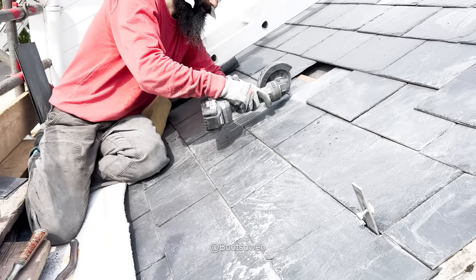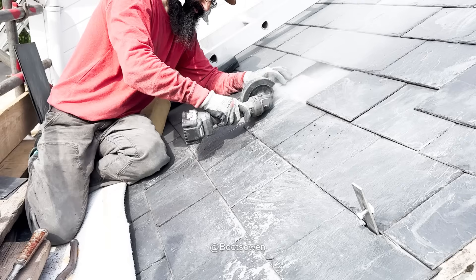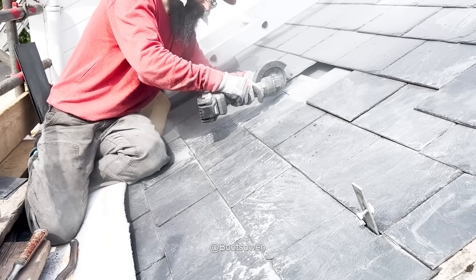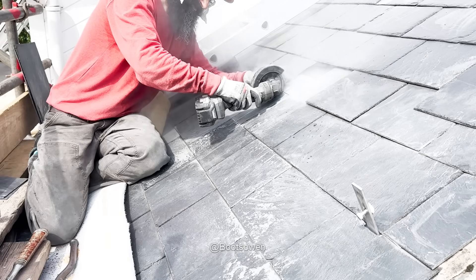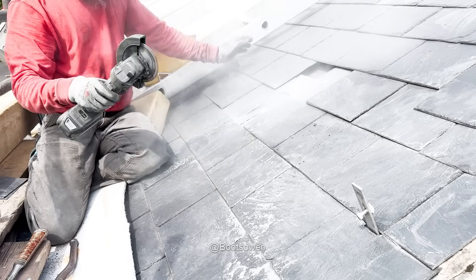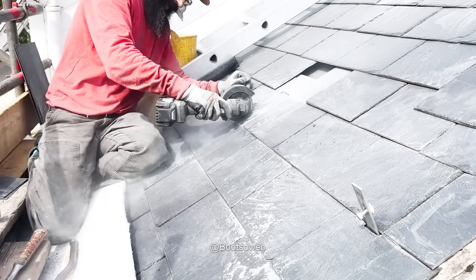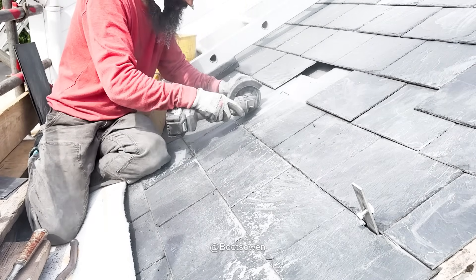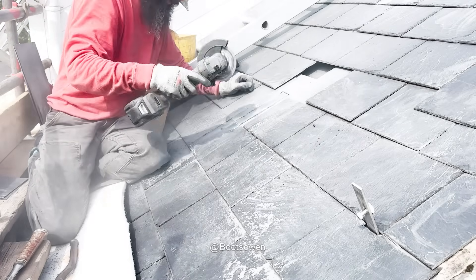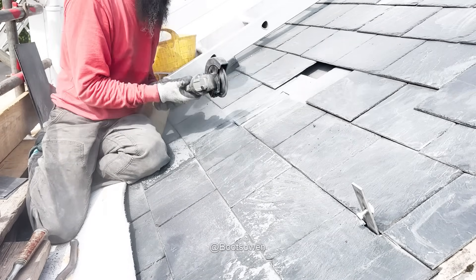Battery grinders are the business. In the past I would have been doing this with a cable and all that bother, or trying to nibble it out or remove the slate and cut it elsewhere. Now with this battery grinder — and this is only a little one, an Aldi one, great little thing — it flashes through and makes a good bit of dust. I've got earmuffs on but not dust protection because there was a breeze blowing. You cut in — you've got to go through all the slates — and you can see why that makes a big hole in your roof, but ultimately I'm going to flash it with lead under and above the slate I'm cutting.